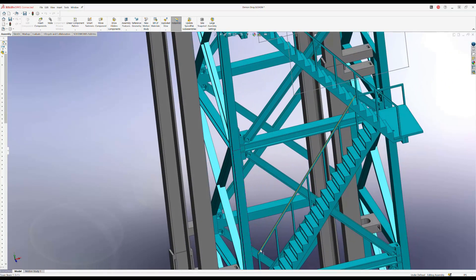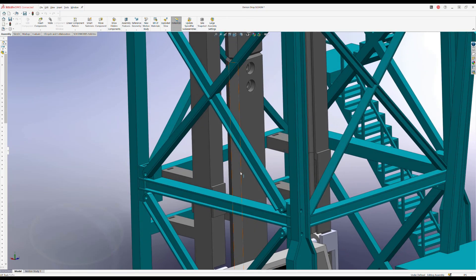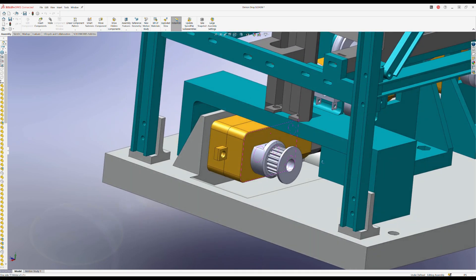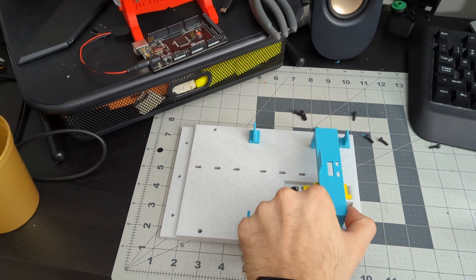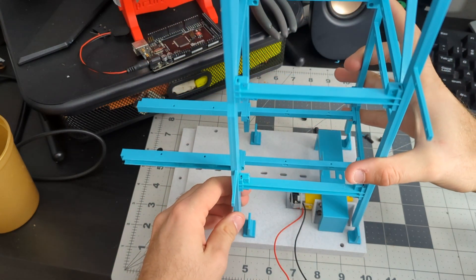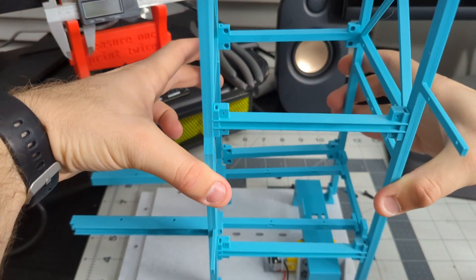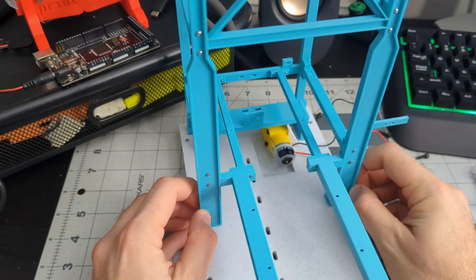To lift the cabins, I created a center rail with a sliding carriage attached. The carriage travels up and down the tower to raise the cabins. To raise them, I purchased a timing belt like what you'd use on a 3D printer, which loops around the rail. The rail sits on a base where underneath I have a geared brushed DC motor. The DC motors I'm using throughout this model are all the same — cheap geared DC motors designed for simple Arduino RC cars. I initially considered printing a gearbox but if I can purchase it for less than it costs me to design it, I'm going to do that.